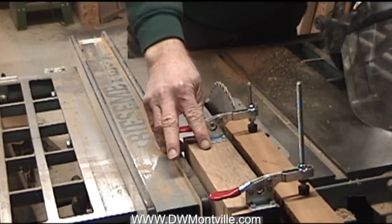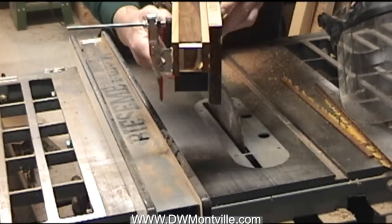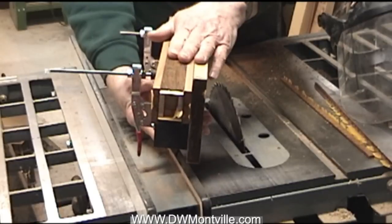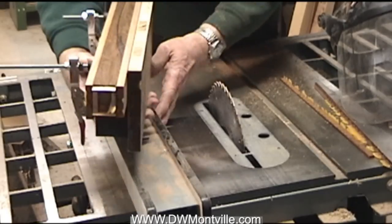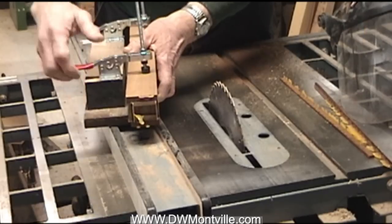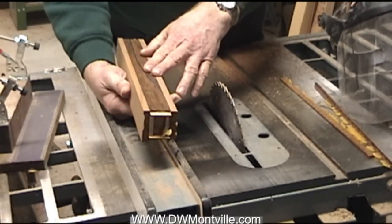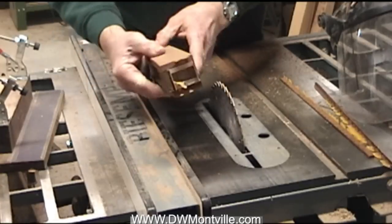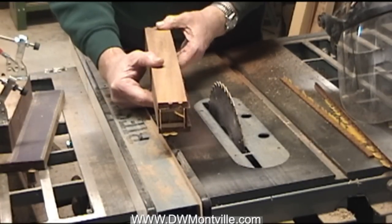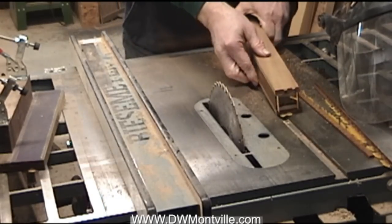I'm kind of conservative about moving when the blade is still moving. Here are my trim-offs, and here's the trim I've done on the surface of my blank. Now I'm ready to take this out of the fixture, flip it around on the rip fence, and trim the other edge — then I'll know they're both parallel and both registered to the core of my handle blank. After a while I'll be selling these blanks on Etsy, so you can look for them there and use them for handles or whatever other project you might have. Thanks for watching.